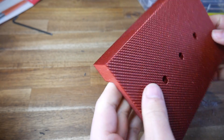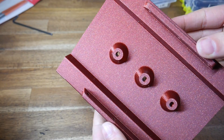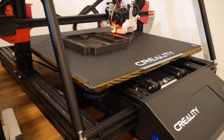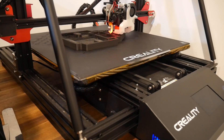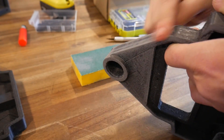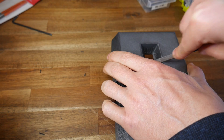The red parts were done in X3D Pro Diamond Series PLA. The sparkle helps to hide layer lines and to me this is a nearly flawless print — I'm particularly happy with the knurled effect on the outer surface. The two end caps were too big to fit on the X1, so I printed them on the CR10 Max. That printer really needs some TLC after some bumps during a move, and because of that the outer walls didn't look great. I had to spend a fair amount of time sanding them down, which has definitely diminished the final product. I also did a little cleaning up of the dodgy overhangs from the X1 parts, but not too much as I plan to reprint those once the slicer has been tweaked.